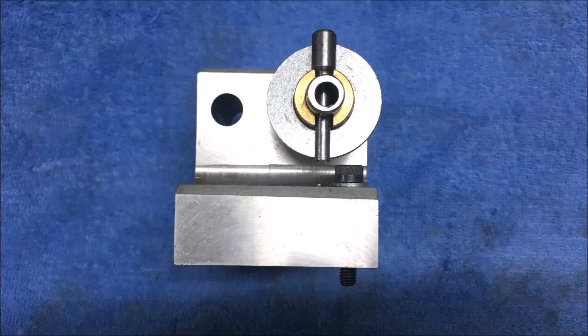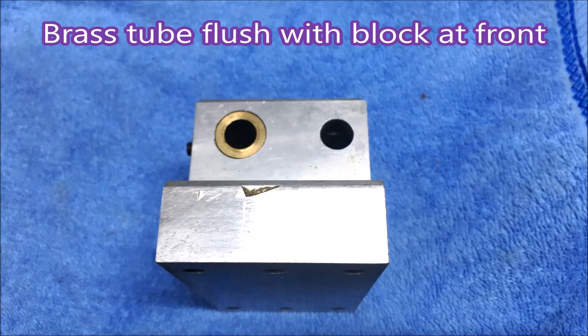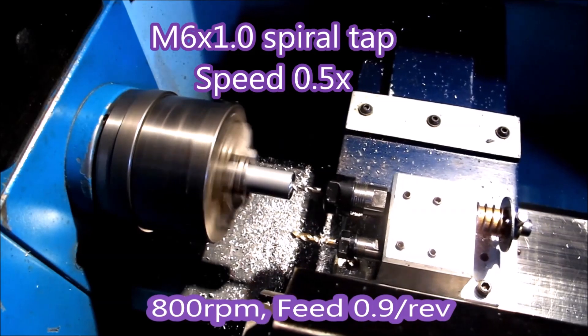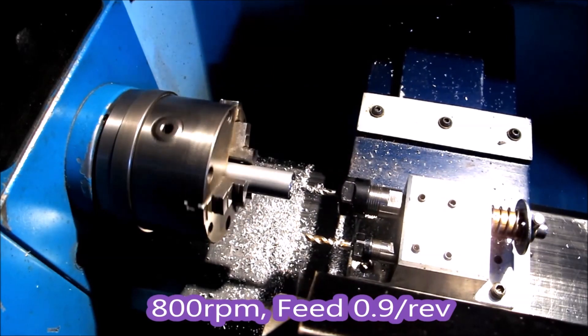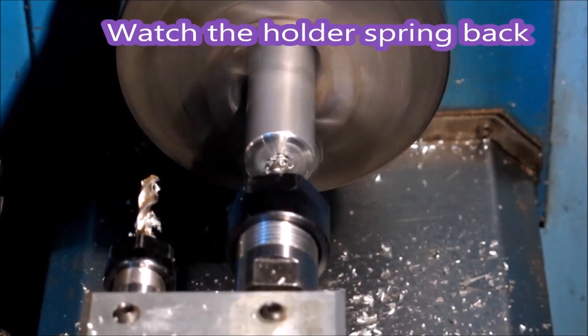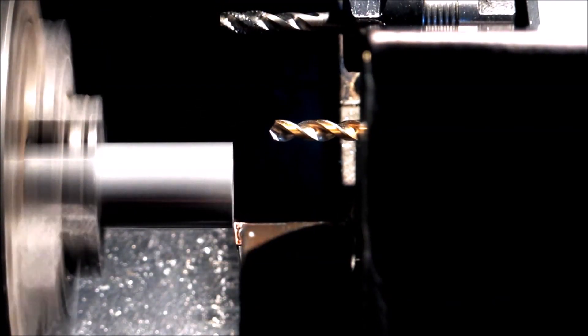Here's a view of the tail end. You can see the brass tube being worn away, but I do do a number of tapped holes so it's not surprising. That's the other end of the tube sitting in the block. I use an O-ring on the shank of the ER16 just to take up a bit of the shock. You can see the thing working on an M6 - it just slides forward as it goes in. You make the feed a little bit under what it should be so that the tap is free to just follow its own threads into the hole.